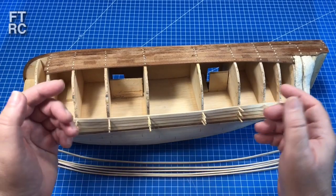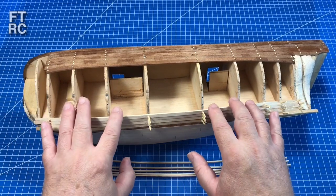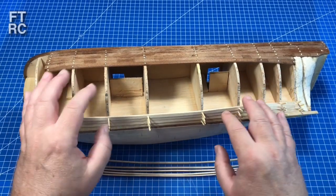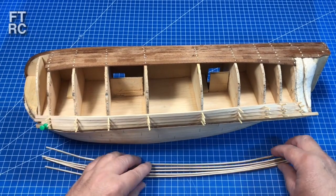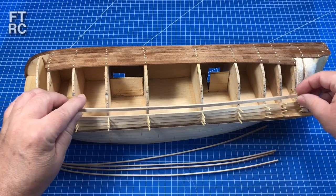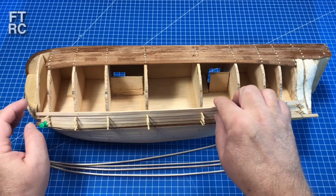Use the opportunity of your first layer of planks to get the hang of planking — if you make a mistake here it's easy enough to rip it off and replace it, or just sand it out and fill. You have got margin for error, so learn and make your mistakes on this layer. Now, with my planks numbered, I can look through my pile and number five should fit pretty well perfectly. Now, tapering — there wasn't much tapering on these planks.